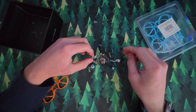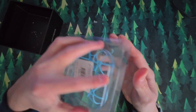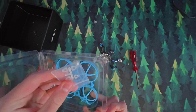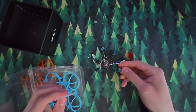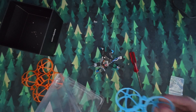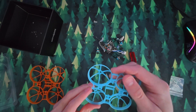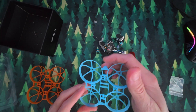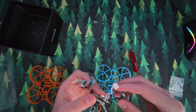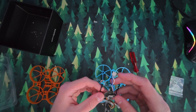So now you're ready to get your replacement frame. This is the replacement frame — it comes in this box, just pop it open. We won't be using the spacers as the motors already have metal ones, so we're going to put it directly on the frame. The orientation does matter for this step. One side of the frame has a triangle and that's the back of the frame. The back motors go there, the pigtail connector goes out the back, the front motors go out there, and the canopy is facing forwards.